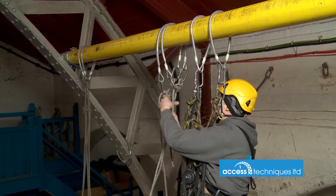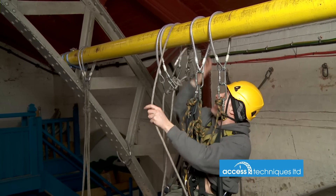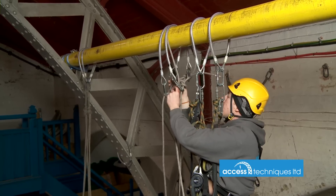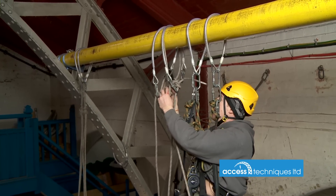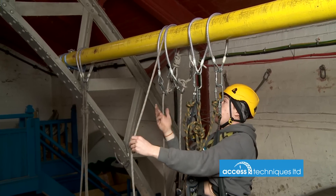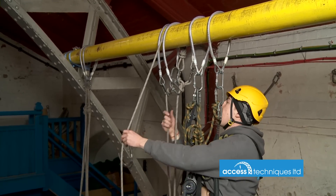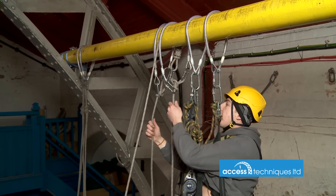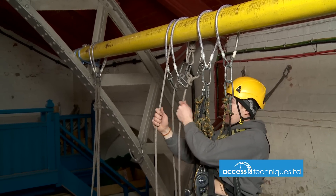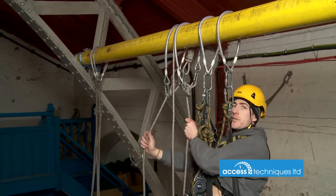So you have to take this rope and just flick it over the beam, put it between the straps, and then just clip it into the common loop — or tie it in, whatever. The good thing about this system is it doesn't have to be a low-stretch rope; it could be a bit of polyprop, it could be anything. It's just retrieving the system. At the minute, it doesn't matter whether I get onto that one with the descender and that one with my ASAP, or even if I was a real idiot and got onto that one with my descender and that one with my ASAP — I still have at least one safe working line.